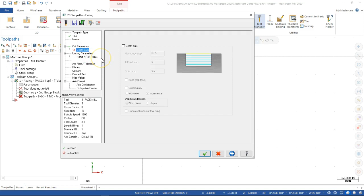Depth cuts, we're not stepping down, removing that material. When we flip this over to remove that sacrificial material in a second operation, then I may use this tool again, and I know that the depth of cut on the insert may only be 100 thousandths, 150 thousandths.